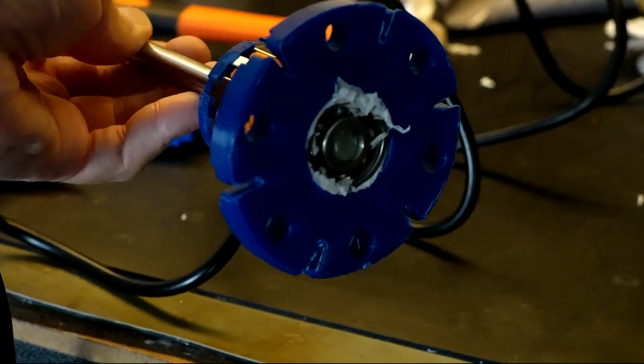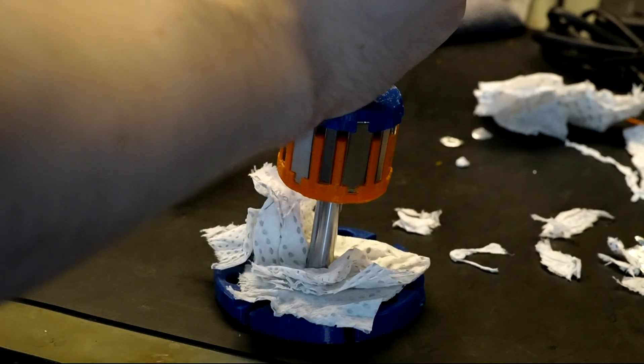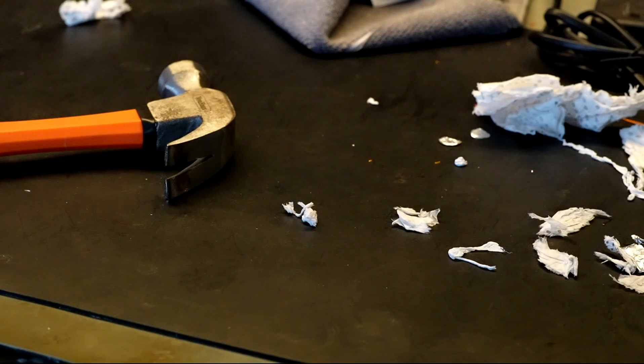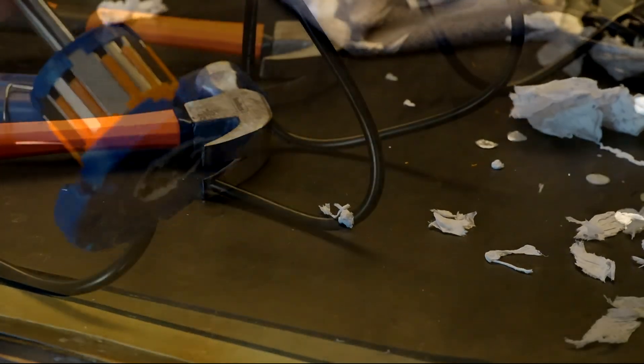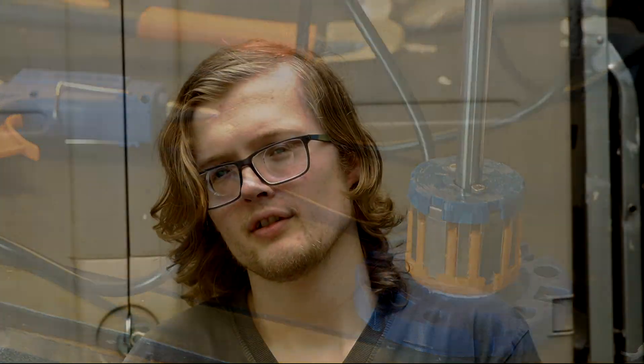The cap STL will be available on my Thingiverse page along with everything else. I had great difficulty attaching the bottom bearing to the shaft and ensuring it had a tight fit. I tried PTFE tape, napkins, aluminium foil — none of them worked, they all kept breaking and tearing. I even tried wedging a piece of copper wire in there but that broke as well. In the end I got fed up and just hot-glued the things together, which again is not the greenest solution. A better option would be to use a piece of strong thin cloth, cut to size, and wedge that in — that should give a snug fit.